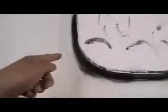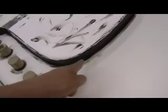But I have to silicone it down so that I'm not getting seepage underneath and it messes up the edges. You want to do this so that it creates a real nice edge, and when we pull it out of the form, you'll see. So next, I'm going to get the metal that's going to go inside the concrete for stability, cut it to shape, and then put that in place, and then should be ready to mix some concrete.